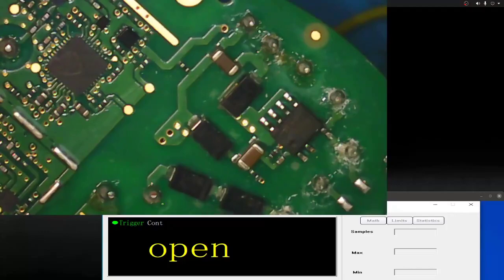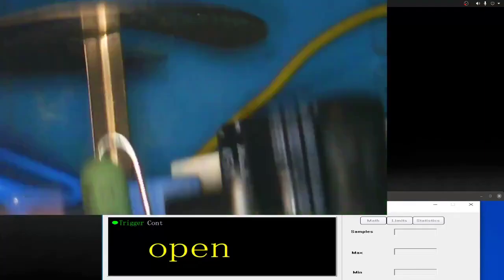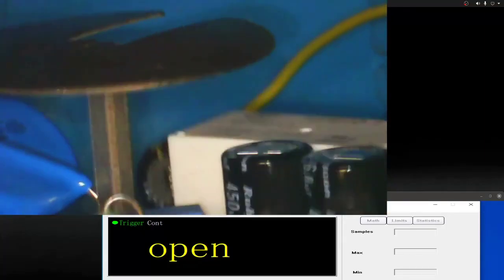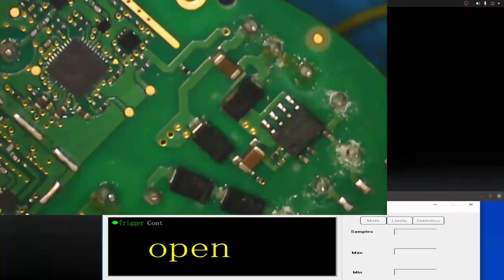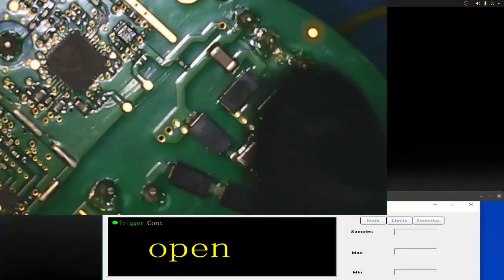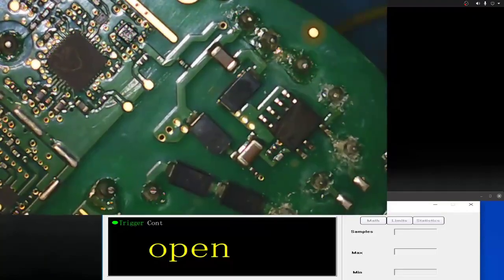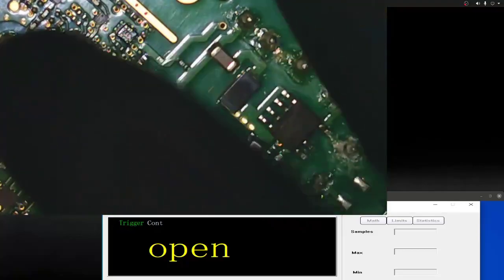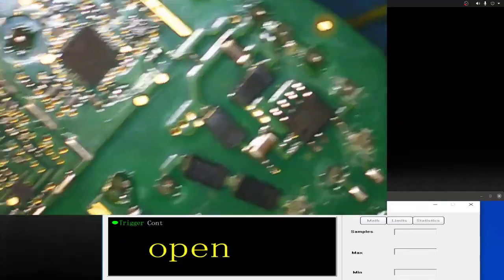So everything that's done is done through this switching power supply, and it's obvious that these capacitors have to smooth the ripple from the main supply coming in. It's that simple. There is no way that the 450 volts especially is getting through that switching power supply into these MCUs. And these MCUs anyway, as I've shown you on the spec sheet, it's going to be the Silicon Labs chip, the 4th generation Silicon Labs chip that's over there. If I get that into shot, we'll talk about it.